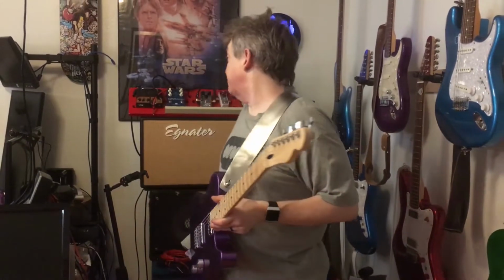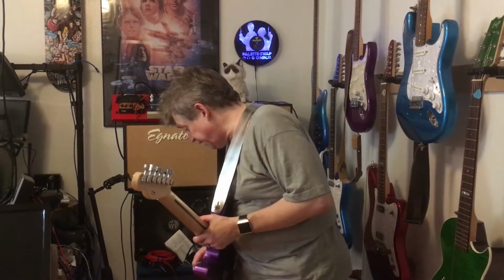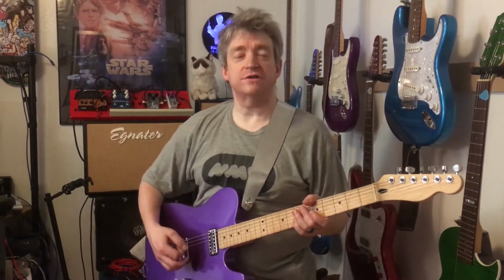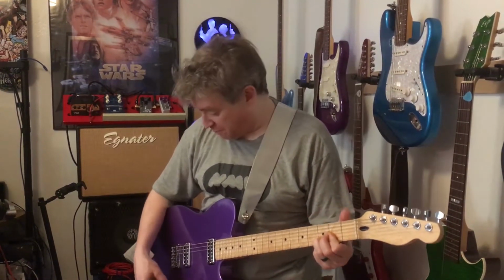So I have my amp on. I have not actually heard it, I have not plugged it in until right now. So this is it. It works. So when the tone is all the way up, it's out of the circuit. So I did get the no-load tone pot to work. So that is both pickups.